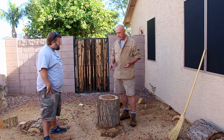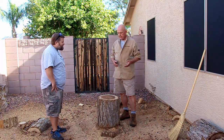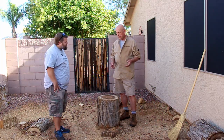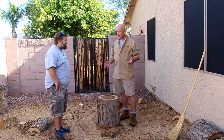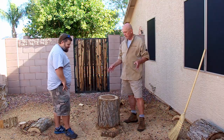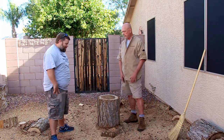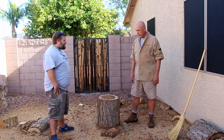To do this you have to have a chainsaw with sufficient power. I have a real phobia about chainsaw chains and keeping them sharp. As luck would have it, I found out recently that you can get a diamond carbide-tipped chain on the market now, and I've got that on my chainsaw. It'll last about ten times longer than a regular chain — it's a little more money, but it's worth it. You want to spend your time turning, not cutting wood. You've got to have a good chainsaw to do this.